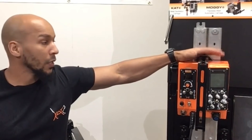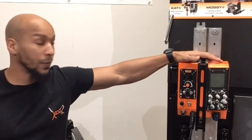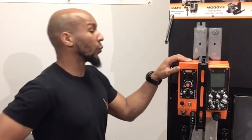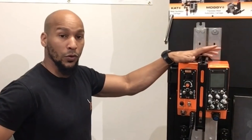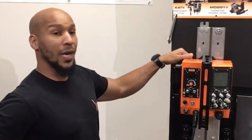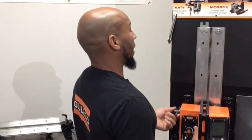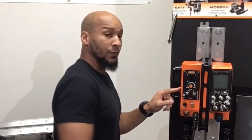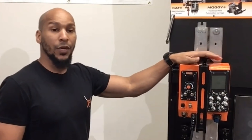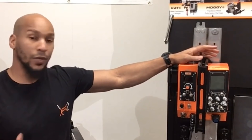We're going to build out the GK 300 linear oscillating carriage just to give an idea of the various mounting positions and accessories that can be used with this equipment. This carriage comes with a 1 to 31.4 inch per minute gear motor assembly which gives it a 56 pound vertical load capacity. The paddle locks and self-aligning wheels are on board, as well as a quick clutch mechanism for rapid track positioning of the carriage. This and other GK 300 series carriages use a tool-less setup, meaning you don't need any ratchets, wrenches, or screwdrivers.